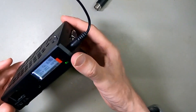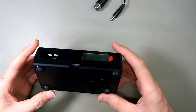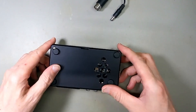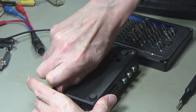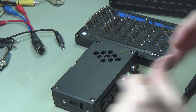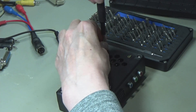This has been done in some other videos as well, but I'm just doing it because I've done one of these before and now I'm doing this one. The first thing to do is to take this thing apart. Some of these have got different cases. This one's got the screws underneath — they've put the rubber feet over the screws, but some of these have migrated a little bit so they're not actually over the screws. This isn't a difficult mod, but it just requires installing one wire. The thing is quite small inside, so you're going to need some quite fine soldering gear and some good magnifying glasses.